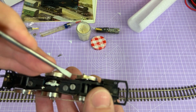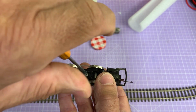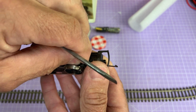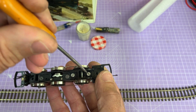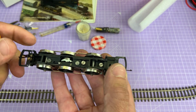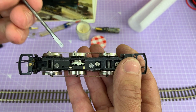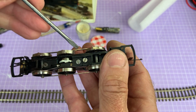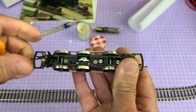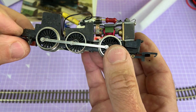It's funny actually, because on some of these models I've actually seen a shim, a little bit like the Ringfield motor models. So I think there were definitely variances in castings and other things, because on some of the Ringfield motor models, 8Fs, things like that, you often find that they've put a shim in there so the gear, the worm to the gear, isn't too tight. And the main thing to do when you're putting this in is maintain a little bit of care to make sure you don't get the worm wheel resting on the teeth of this spur gear, because it's been known in the past for people to put the motor in and think it's in and tighten up the screws and bend the armature shaft, and that's especially common on Ringfield motors.